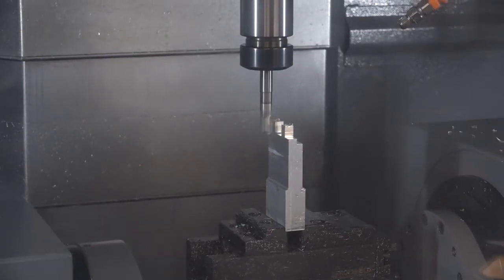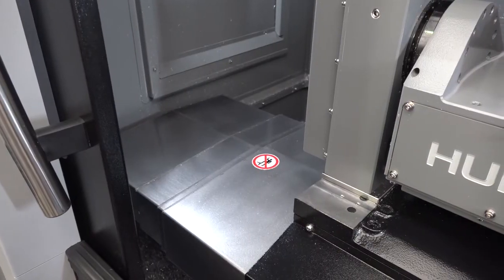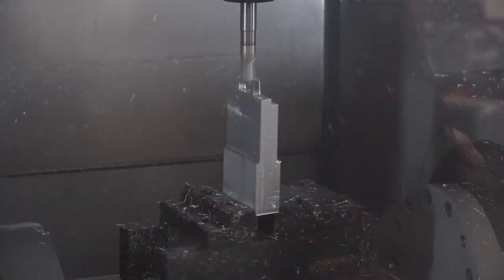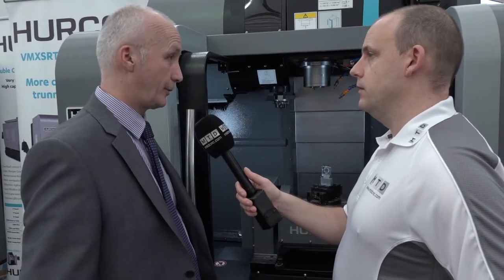The working envelope: you're cutting anything on a cube size of around 250 millimetres. The travels are more than that — you have 500mm in the Z-axis, with an extension on the Z-axis to allow for larger parts to go underneath the spindle. Typically when you try to go three-plus-two you very often lose Z-axis height, which is a disadvantage. The advantage with this machine is that you don't actually lose any Z-height — you actually gain a little bit. 10,000 RPM spindle, 20 metres rapids, 20-station swing arm tool changer, all along the same lines as the three-axis machine.